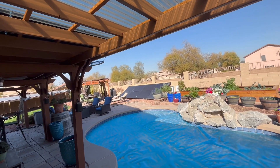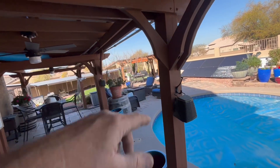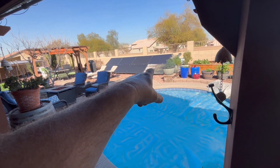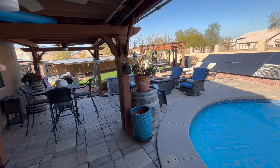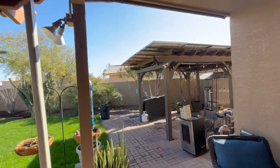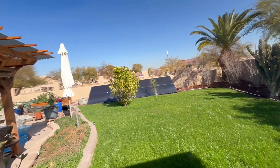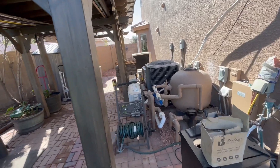These pergolas work really great for mounting solar panels on top. You just have to keep them clean. I have the pergola panels at a slight 3-degree angle for water to shed off. My main solar array is at about a 40 to 42 degree angle, one shed array is at about 5 to 8 degrees, and another is at just 2 to 3 degrees — just enough for water runoff. I cleaned the far pergola with the bifacials and this one today and we're getting great output.